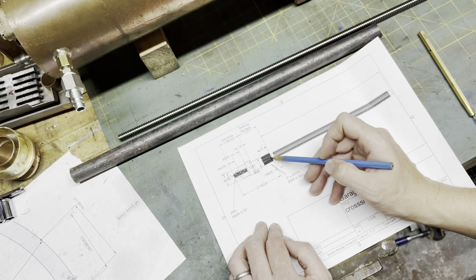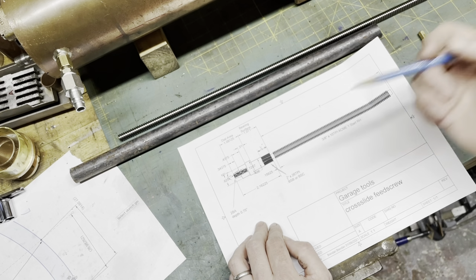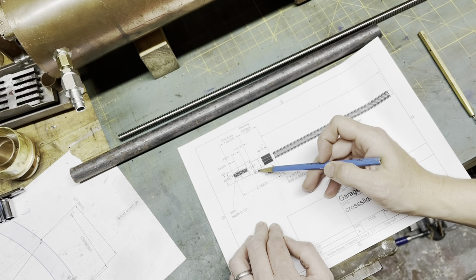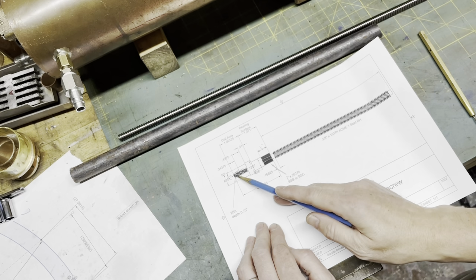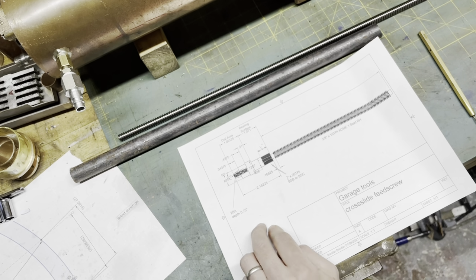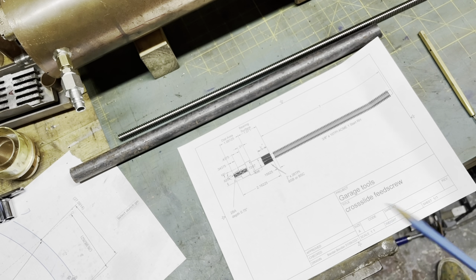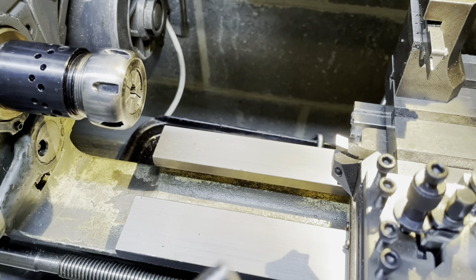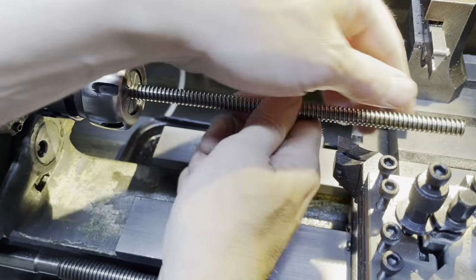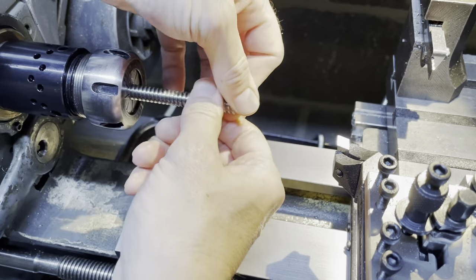So we're going to do this end first, then flip it around and pop it in a collet chuck, because I just happened to have a 1/2" collet chuck, and then machine the back end. The thread size is 2BA, so there you go. If anybody requires this plan, I can maybe link to it in the description below. Let's chop some material and see what happens. Okay, let's do this. Start with the bar and tidy up the end, and then do the other end.